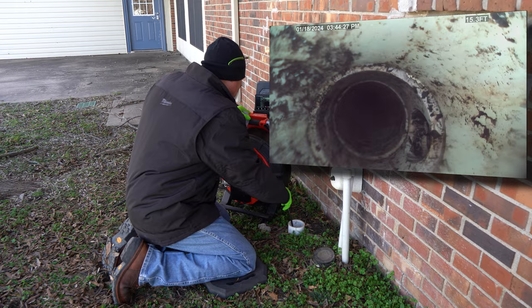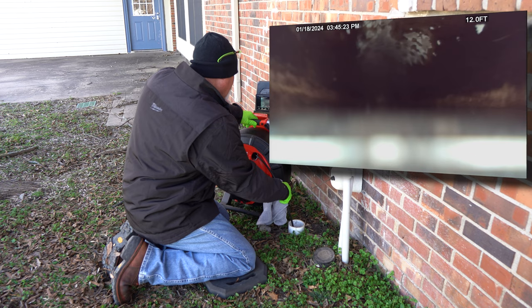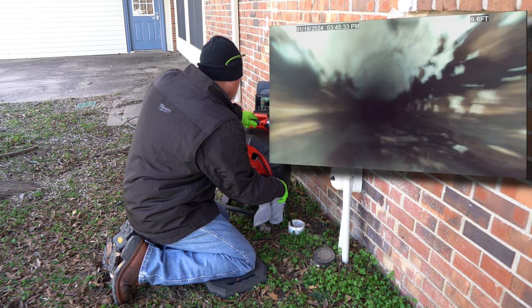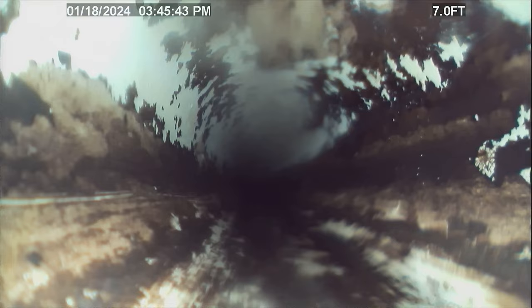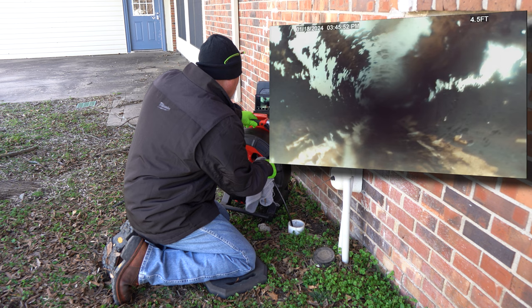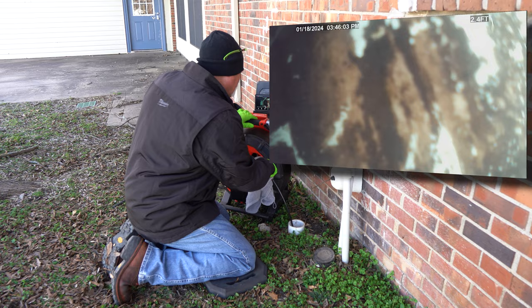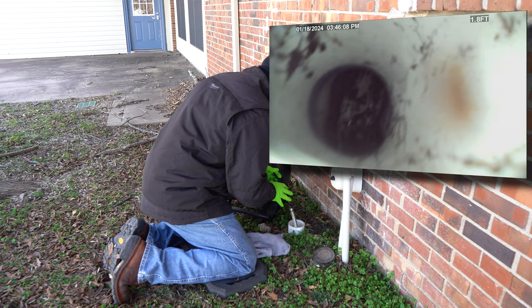As I'm pulling in I'm looking up towards the top, trying to look above the water to see if I can see anything that could be a break. To be honest I haven't seen any signs of a break yet. I'm about seven feet in right now. This really doesn't look too bad - we've got PVC pipe with a lot of build-up on the inside. This house was built in '84 and this end was added a few years later. I want to go ahead and turn and go the other way. I don't have to go very far because back about where y'all are there's a septic tank, so be careful where you step.